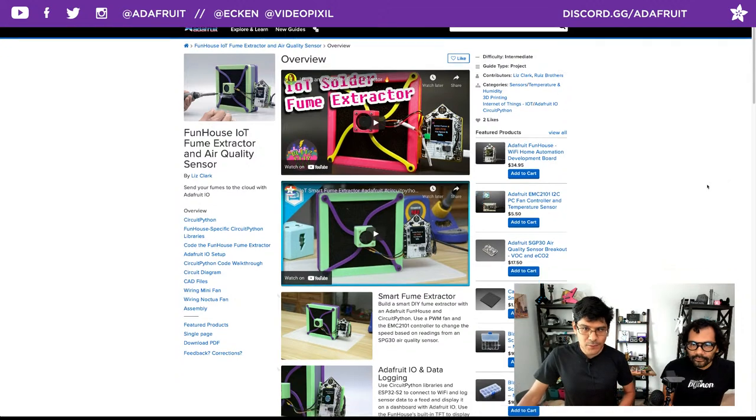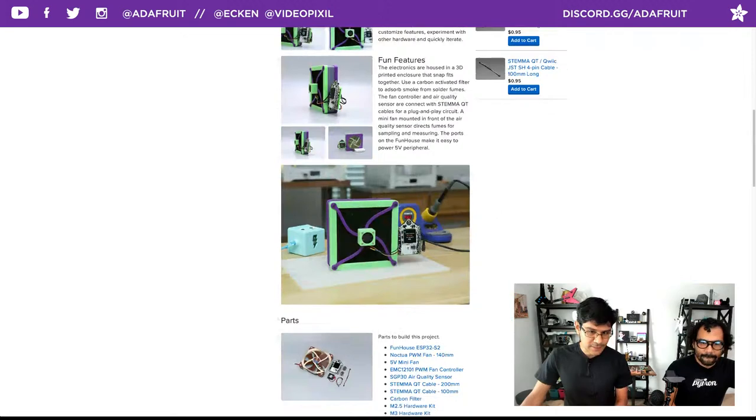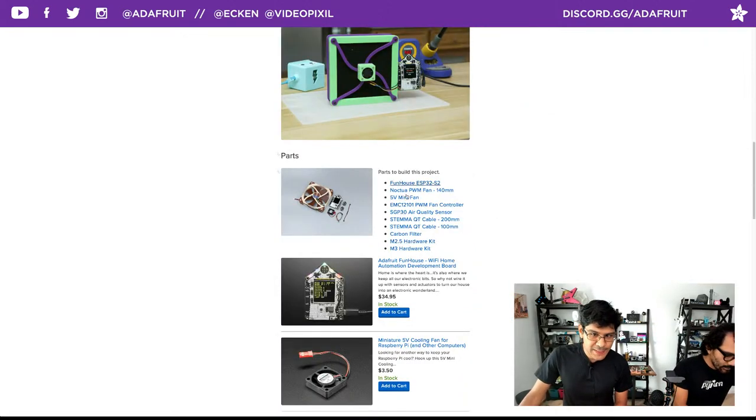Please do so. Yeah, so all the parts are listed here. So if you want to check out any of the parts, the whole parts list is all listed here. The Noctua fan is probably the only part that's outside of Adafruit, so if you want to pick that up, you can get it on Amazon or search your favorite online supplier for a Noctua fan. It is the 140mm style, and there's lots of different styles of Noctua fans. You have to make sure this one is 5 volts, because there's a lot out there that are 12 volts for PCs and stuff.